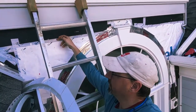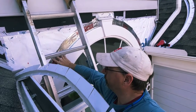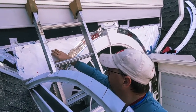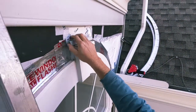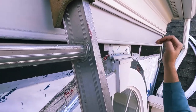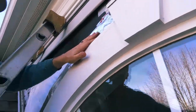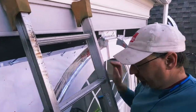But any water that gets behind the tape is still going to be in front of the Tyvek and will come out at the bottom. We've got some window flashing tape helping to seal what's going on here, and we may look at adding one more piece over this. We had one more major deficiency up here — this piece of metal and how it was set. Michael said the way it was set up, any water that hit here was pretty much funneled right into the house, which explains the water damage they showed us inside the window. So we're pretty confident that fixing that is going to solve that piece.